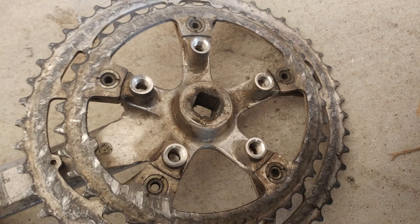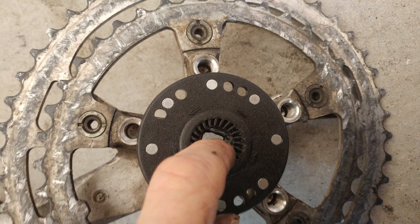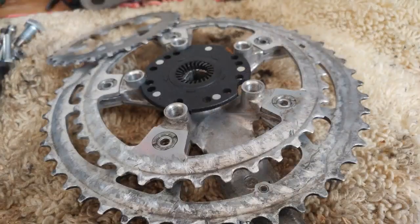The next problem was that the magnet ring was too big to fit inside the housing stanchions of the small ring where it bolts to the sprocket assembly. On top of that, the ring bolts were in a five-point pattern and the magnet ring had eight magnets. But they anticipated this — they left holes for relocating the magnets. I rotated the magnet ring to find the position requiring the least magnet swapping, marked everything, and took it to the grindstone. Once I had it notched out and reconfigured, it fit within the sprocket ring assembly quite nicely.